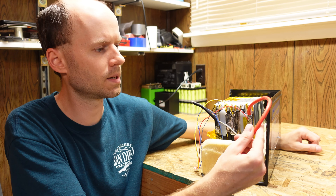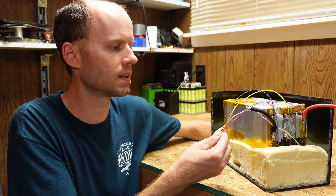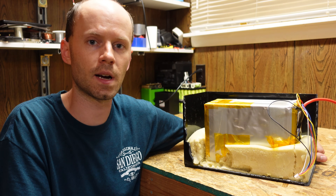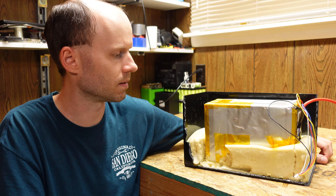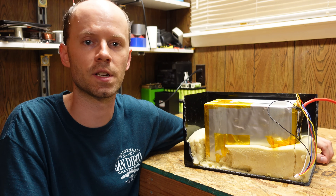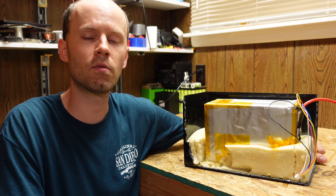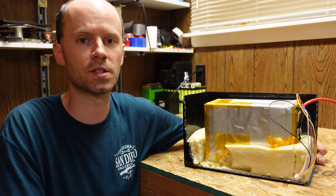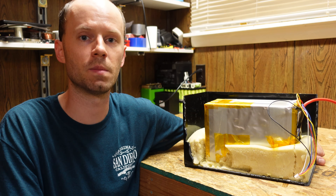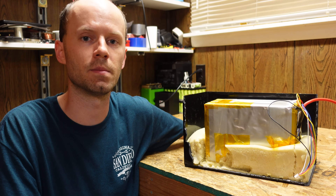The BMS did look pretty good otherwise. The wiring could have been a little thicker, but even the balance leads use silicone-insulated wire — not cheap wire. Unfortunately it appears I damaged this battery while taking it apart, so I'll have to discharge and recycle it. That's very unfortunate given what I paid, but I go into these things knowing I could potentially damage something, which is why I always do capacity tests before taking stuff apart. This battery was clearly not intended to be serviceable — it was glued together very well.